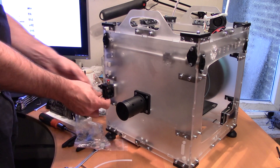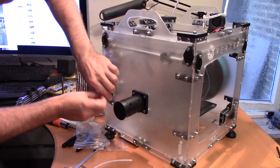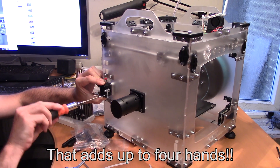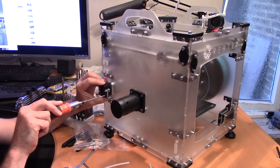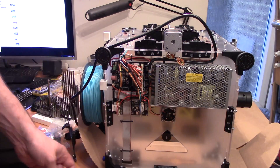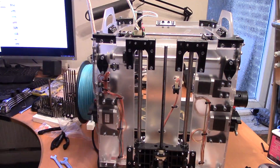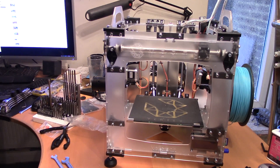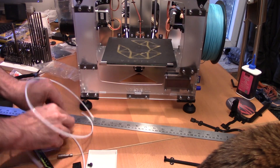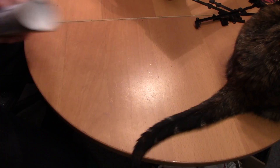That is a real pain to get into place — it's one of those things where you need three hands: two to hold it, one to line the screw up, another to actually drive it in. But we're in. We have to install the stepper motor driver on the underside of the board, which comes in the extra add-on kit. The final bit is to install the PTFE tube between the extruder and the hot end — they say you want exactly 700 millimetres of that tube. So with that the extruder's in, and now we're on to installing the LED lighting kit.